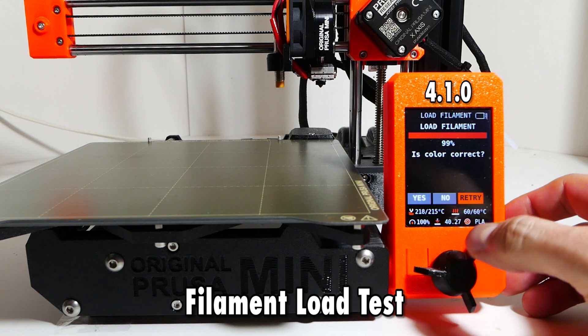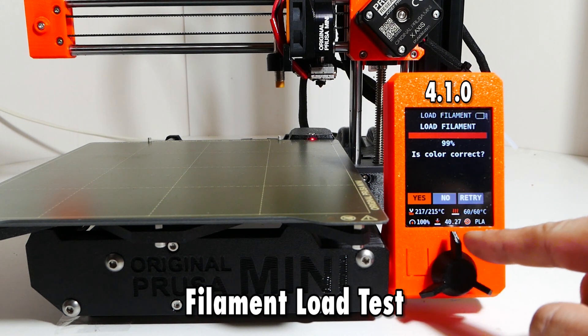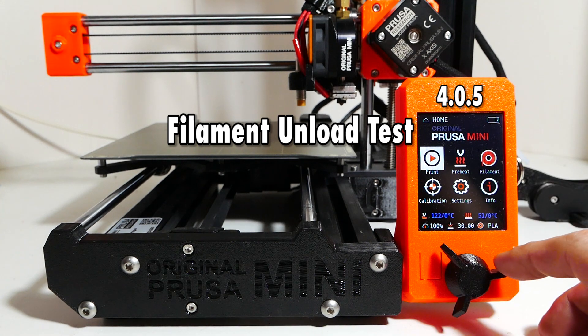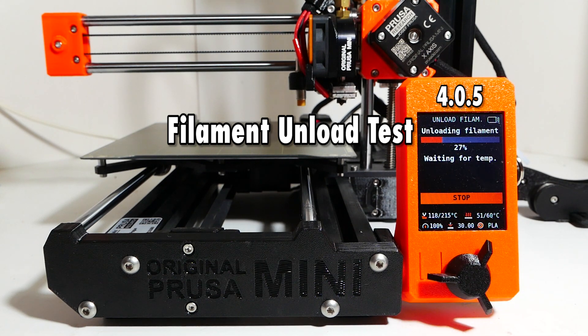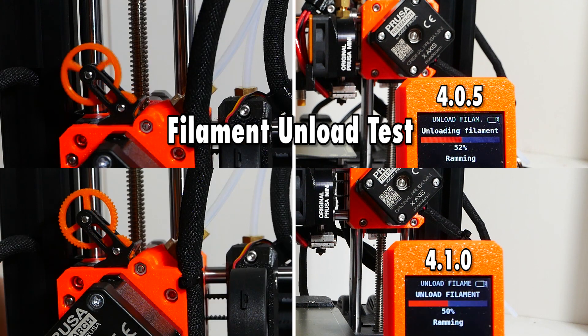There's also now a retry option you can select from the click wheel. I also tested the unload sequence since that has changed too. In 4.0.5 it waits for the temperature to stabilize — same in 4.1.0. But the interesting part comes when you compare the two behaviors side by side, which are quite different. In the side-by-side comparison using my cogwheel mod, you can see immediately that 4.1.0 finishes the unload sequence much earlier than the previous firmware.